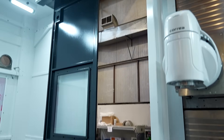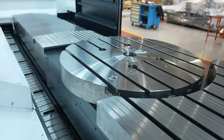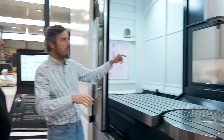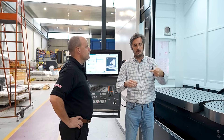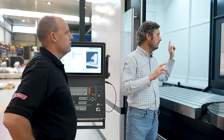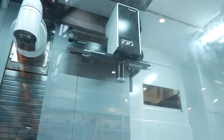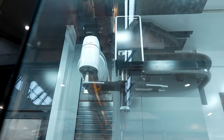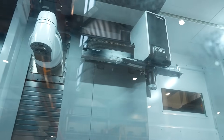That window there — is that a door? Can that open so you can see from the other side? Yes. These machines usually allow you to move the control from this side and from that side. When working with the tooling in vertical position, from this side you have a perfect view. But when cutting with the tooling in horizontal position on the back face, you can't see from here, so you move the control to the back for perfect visibility. The tool changers are kept out the back with a curtain, so when cutting, chips and everything are kept contained and nothing goes into the tool changer.